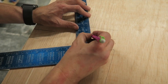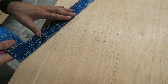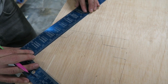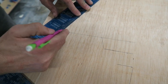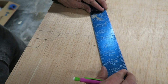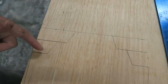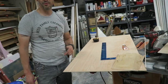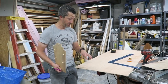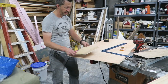It's not super scientific — you're just making it how you want it to look. I'll connect the lines across and try to keep that same angle, eyeballing it since it doesn't have to be super precise. Now you've got the shape you're going to cut out on your table saw — this gives you a couple of steps for your necklaces. If you're going to make several, I really recommend making one, cutting it out, drilling your holes, and then using it as a template for all the others. I'll use this existing one as my template.